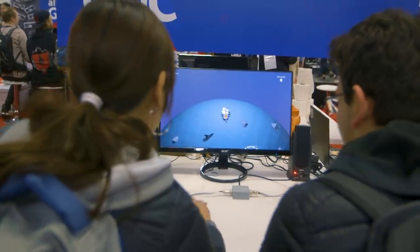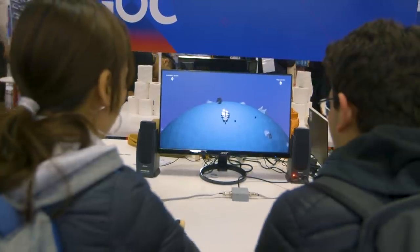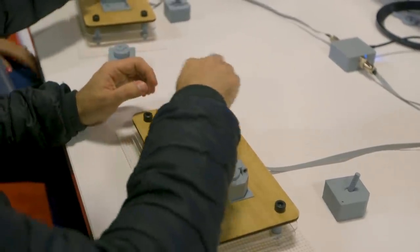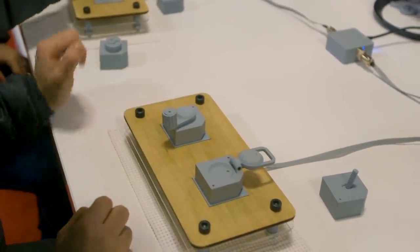All of them are being fed into a computer — they go through an Arduino Micro and that goes straight into the computer. Is the computer reading them as HID input, or what's the software looking at? It's just a serial port packet that we define ourselves and parse with our application on the front end. We do as little processing of the actual input data on the Arduino as possible, because that would be slower — especially when we're doing the sine and cosine functions for some of the inputs. We're just sending it straight to the computer over a quick serial port message and parsing it there.